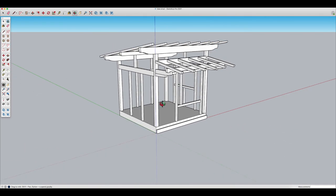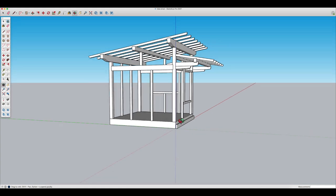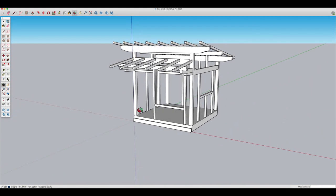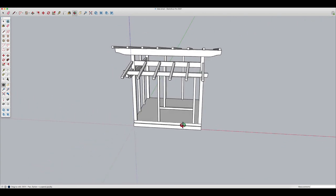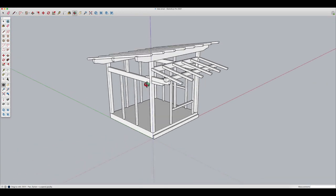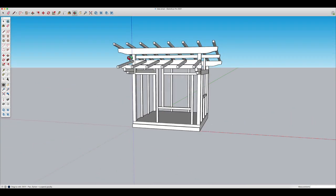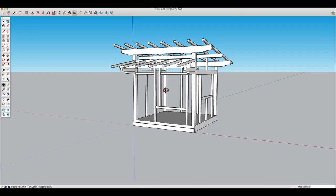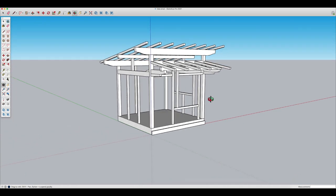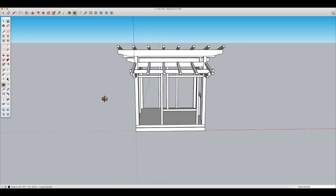So yeah, we've got this little 5-foot overhang here, and I'm going to build a little porch with stairs coming up here from the side, and clad the whole thing in tongue and groove with some rigid insulation. So there won't be any thermal breaks because it'll have a solid layer of probably 3 to 4 inches of rigid styrofoam insulation, probably 5 or 6 inches on the roof. So it's going to be a very cozy, warm little cabin, and I'm going to put a tiny little mini fireplace in there to keep us warm. So I'm looking forward to getting going on it. Let's go plane some timber.